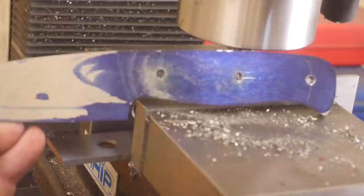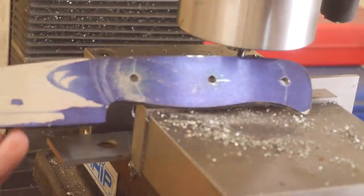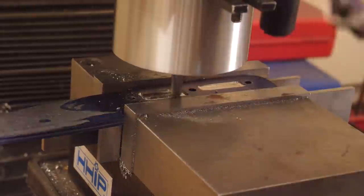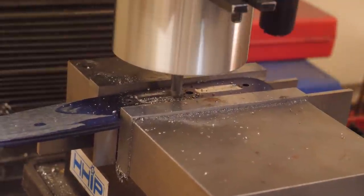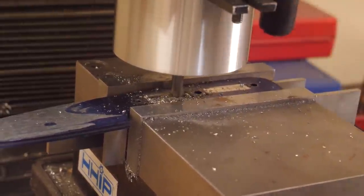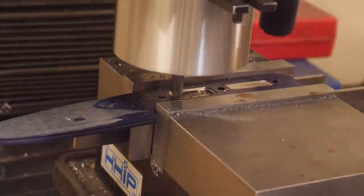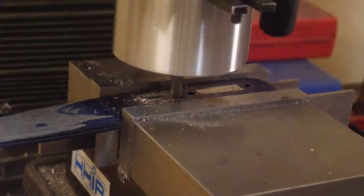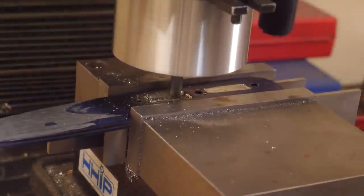While we're on the end mill, I'm going to cut out some areas to lighten the handle and achieve better balance. I'm not going to show you all of that process because it was long and drawn out, and I burned up three different mills doing it. The mills cut very well to start, but all of a sudden they just quit cutting. After a few minutes each, they become dull to the point they do very little or break suddenly. It's a bit of a disaster.